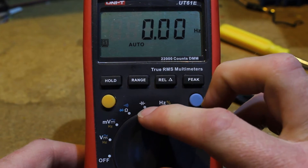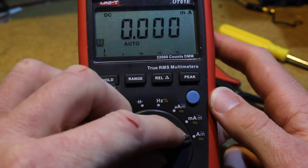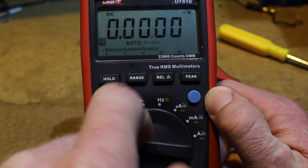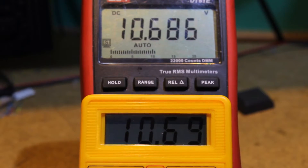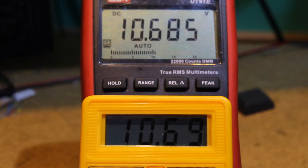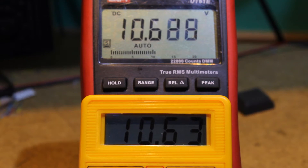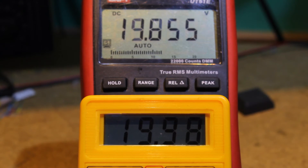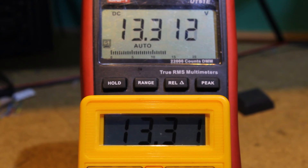Kind of iffy on any of the ranges apparently — just take it apart and clean the switch contacts, that's all it takes. Filed under 'now what the heck, why not' — just to make sure I didn't mess up any of those pots, I tested it against my Mastech 830B. Still looks fine. That did not mess up the DC voltage pot. Looks good to me.